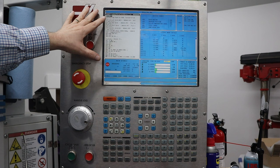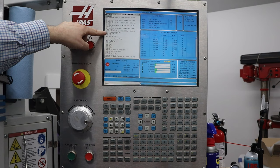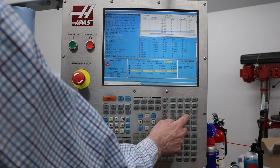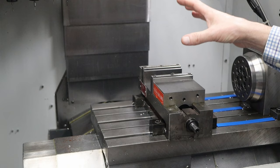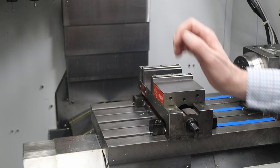So that way I can program to the first 15 tools. If there's something that doesn't fit in the first 15 tools it'll be above those numbers. This is all T6, 7, 8, 9, and 12, so I'm good to go. I'll do a hand jog so I can position the vise to be ready to load the material. I like to move the vise all the way to the right so I have room to hit the stock with a dead blow hammer, and that way I won't hit the tool by accident. I'm still pretty careful each time because I don't want to break the tool.